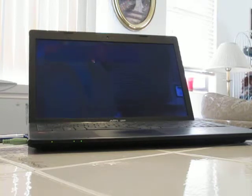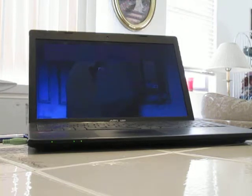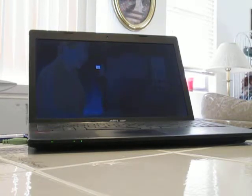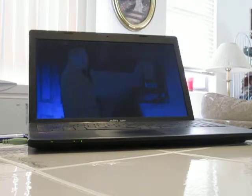Anyway, first thing you want to do is make sure that the filter in the front is cleaned out. This thing is dirty. That air conditioner is not going to work very well. This one's out here at my new workshop. It's all covered with sawdust, but anyway. Try to keep this thing cleaned out. Try to keep these coils cleaned out, too. Otherwise, your air conditioner is just going to run overtime. Not do a good job.